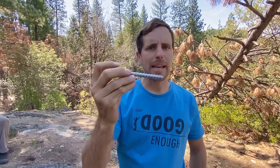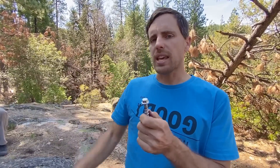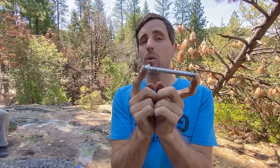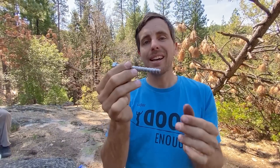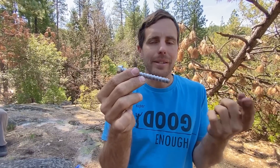While we're on the dirty hole topic, the other kind of bolt we like to use is concrete screws — Titan HD, Simpson Strong-Tie. Links in the description below. Most of our tests, the things holding the Bolt Buster hydraulic right now are these, because they're pretty damn strong. We tested some really thick hangers and they were snapping the heads off above 40 kilonewtons. They're easy to take out when done. However, you don't want so much dust at the bottom that you can't put the bolt in, but as the screw grinds down the sides it makes more dust, so sterilizing a hole for these obviously isn't that important.